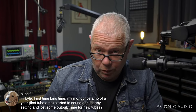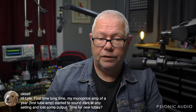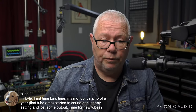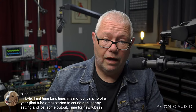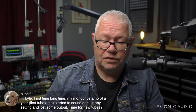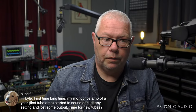I'm glad it has been working for you, and I imagine that you're some tubes away from it working for a while longer. But I would not put too much money into keeping that thing going. When it does begin to fail, any repair would quickly exceed its value, and that's the sad reality of the Monoprice stuff. But if you have access to some 12AX7s, see if it's just one 12AX7. You may be $25 away from a functioning amp.